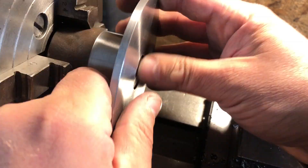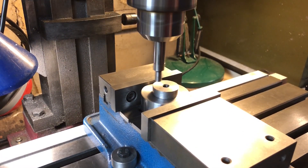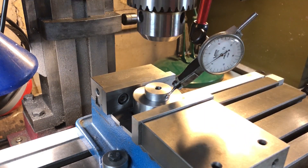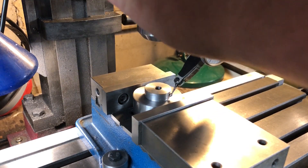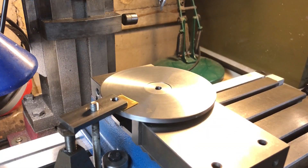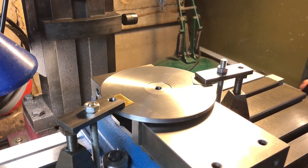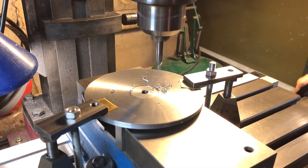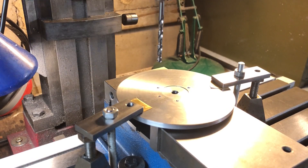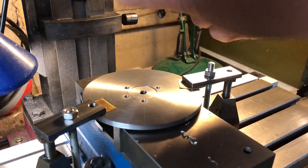Let's take these over to the mill to finish the drilling. With the mandrel parted off and held in the vice, I can centre find the part, and then use this to hold all three plates in the same place for drilling. After double checking my alignment with an indicator, I can mount the first plate. I have it resting on the jaws of the vice rather than on the shoulder of the mandrel, and I'm only applying light pressure on the clamps to avoid any distortion of the part. I am drilling the same hole pattern as the mount from last time, and again I am using the bolt hole feature on the DRO to space these out.